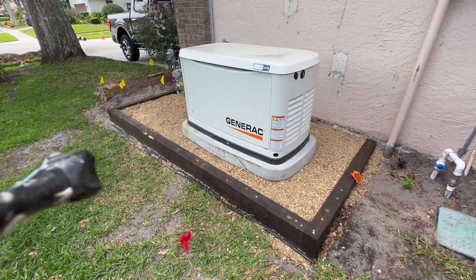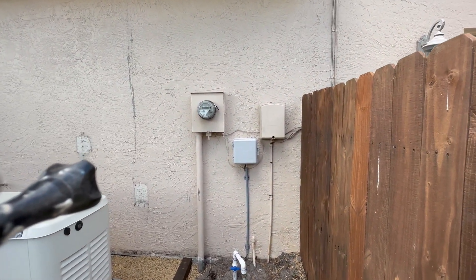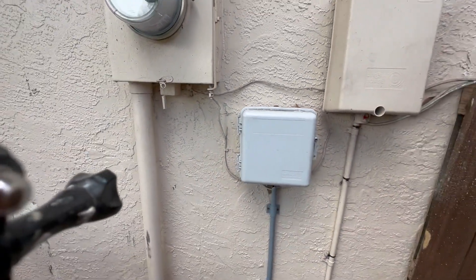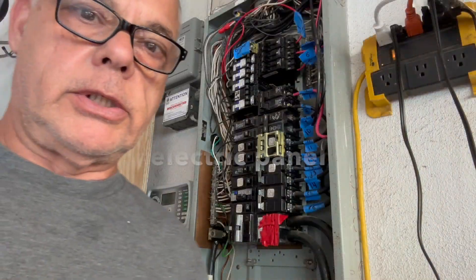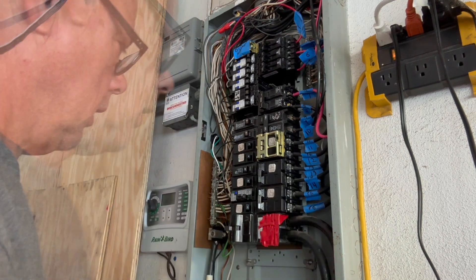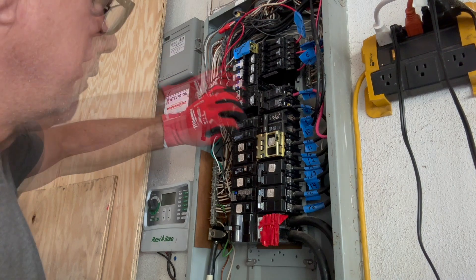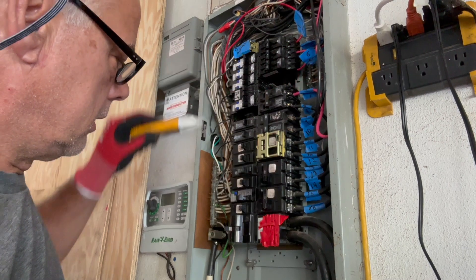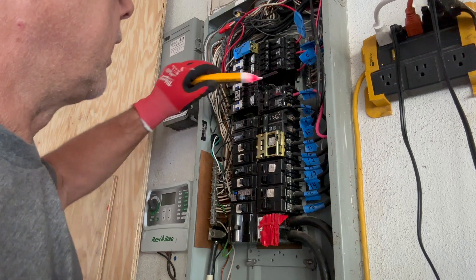You've got the generator out here, and I'm going to put the new panel up there. I got to move some of this stuff here — that's why I'm doing it. Once this box is installed, then I'll disconnect the jumper wire. So I'm going to shut the meter off right now and double check it to see if we have any power going to it. What I like to do is hit all the breakers off. I just want to verify to you that it still has power — yes, still has power. So I'm going to shut the main breaker off and that'll dissipate all the power.